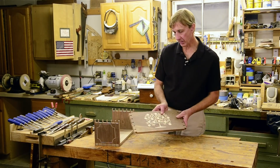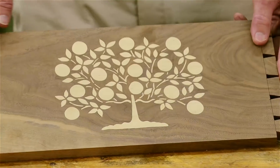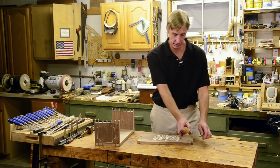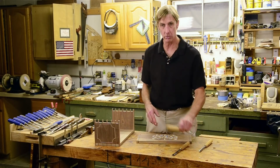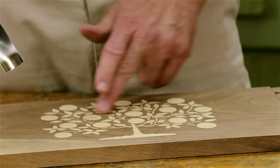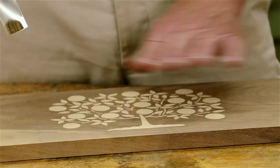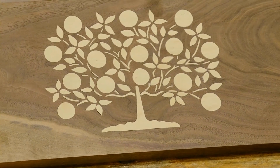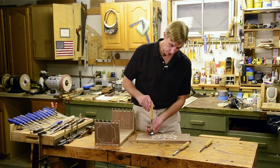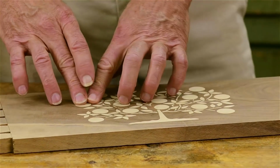The inlay on all my prototypes was done by hand. I use carving gouges, and I essentially make the size of the inlay according to the size of my carving tools. This is all recessed, and then the holly is inlaid to give you that final Tree of Life. I'll use curved chisels and just essentially hammer out the recess with a mallet.